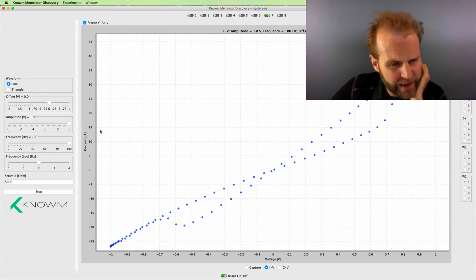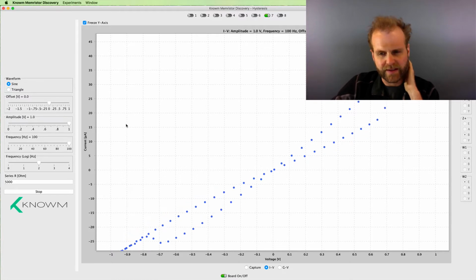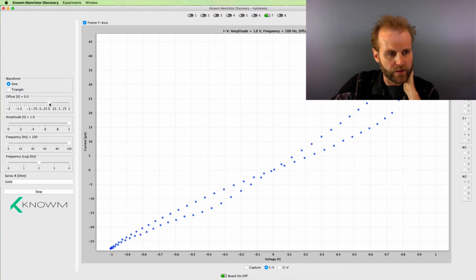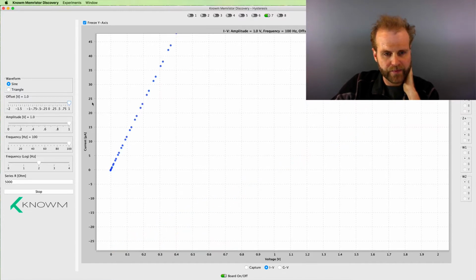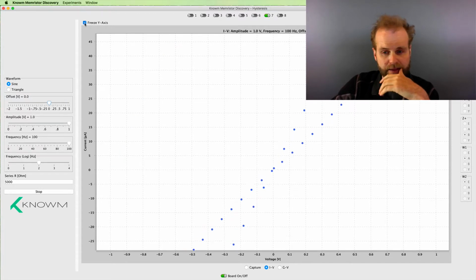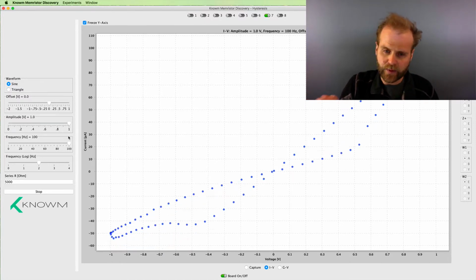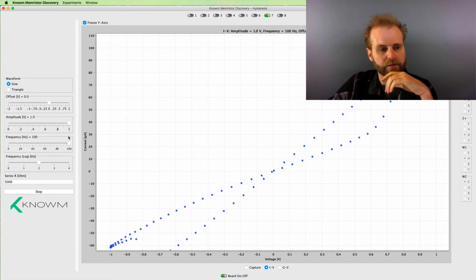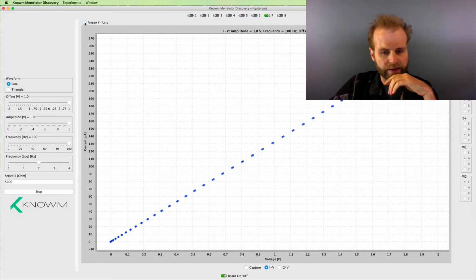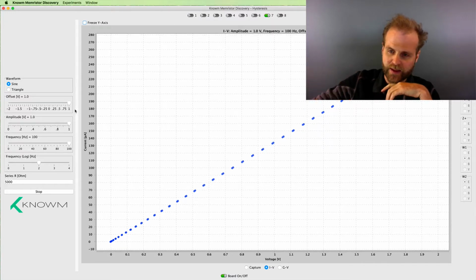and we kind of want to get up almost to the milliamp for this board, with all the RC effects and whatnot. So we're going to see if we can drive this here. Let's add some positive offset and go back to 0. Notice that I have greatly increased the slope of this. What I did was apply a sine wave, and I just biased everything by a volt. So I have a 1 volt amplitude sine wave offset by 1 volt.